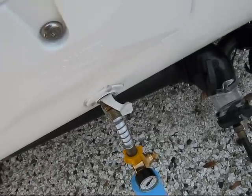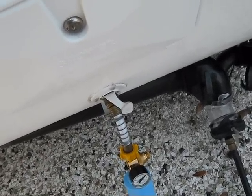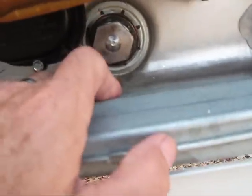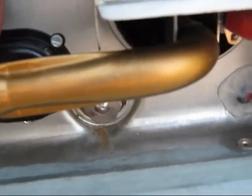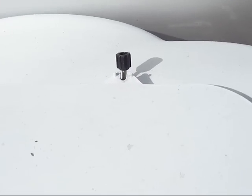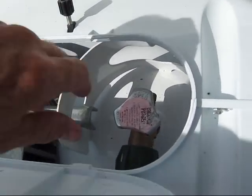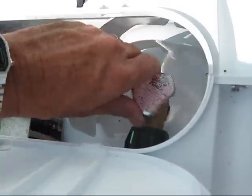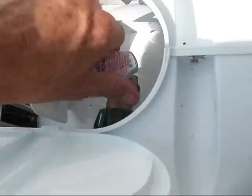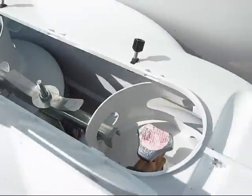Open that up, do the same thing — hot and cold water — let them run for a little bit. Now, once we're filled up with water, we want to make sure there's no leaks or anything like that. And now we're just going to check gas operation with the heater to make sure it works properly. We're going to go around — it's going to bang on us before we open it, because here in Florida you never know what's going to be inside. I'm going to turn our gas on, turn it all the way open — actually you don't have to go all the way open, but I like to because it firms up nice.